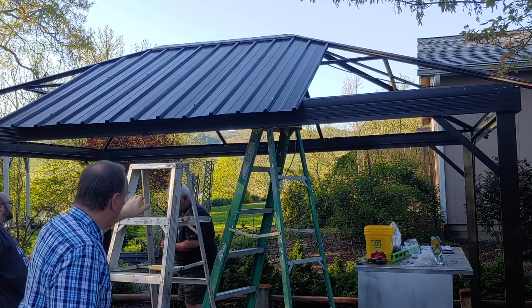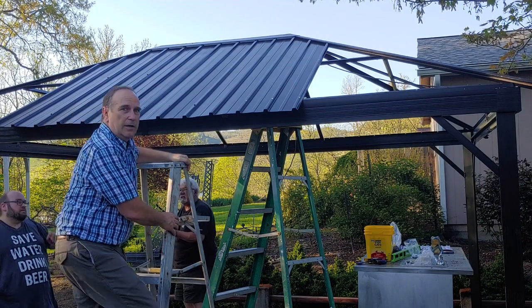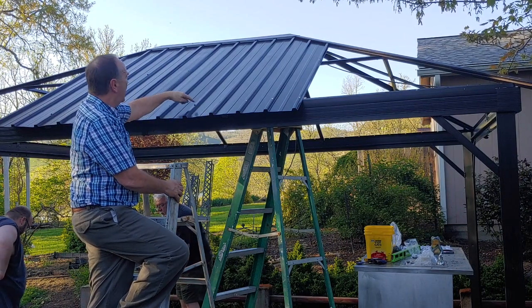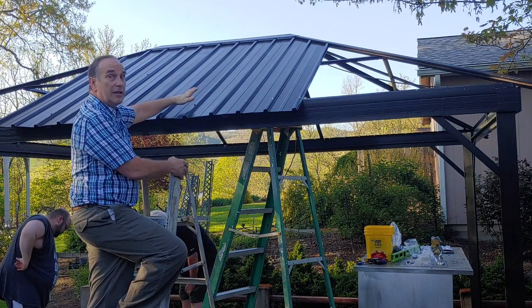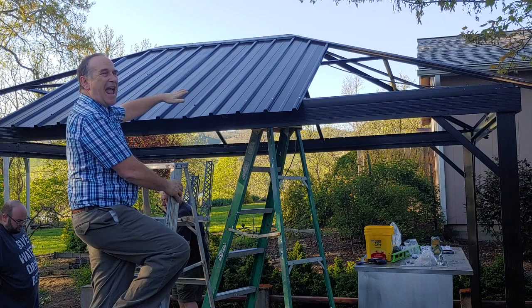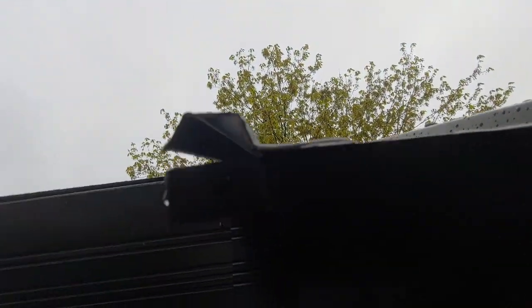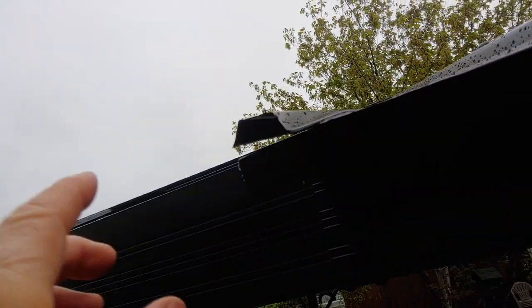We're starting to put up the roof — we've got our first two panels up. It's a little bit difficult but not too bad. The channels go in the up position rather than the down position, and you've got screws in a few different sizes — we're just packing it in place right now and will tighten it down later. Another thing to be aware of: at the ends there's a kind of flat area. It's not completely flat, it's straight down — this will be the top and the flat end will be the bottom, so make sure you put the flat end on the bottom.